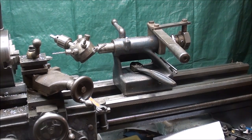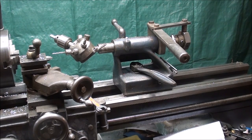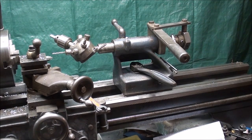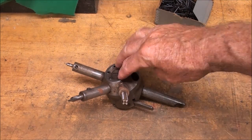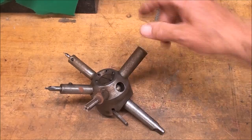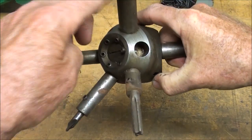Just a few minutes ago I took the regular tailstock quill out and installed one I had in storage. This turret here is also an attachment that came with this lathe, but I already had one — you can buy those anywhere. The tailstock turret I showed you on the machine was one I already owned for some time; this is the one that came with the Logan lathe and I'm not using it, but it's very similar. It's just a number two Morse taper that goes into the quill, and we have a six-station turret.